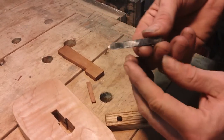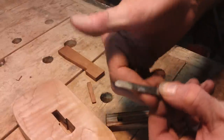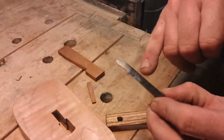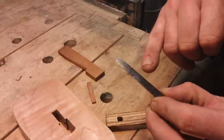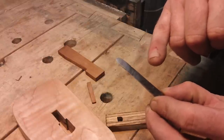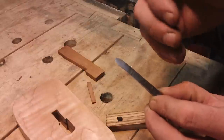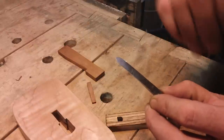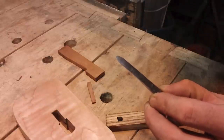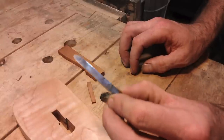The iron is flat on one side and it's solid steel. This is a piece of file steel, spring steel, and an old chisel I had laying around, so it's some tool steel. It's three pieces of steel welded together, and I folded it three times. So three times three is nine. That's however many layers. I can't keep up with it.